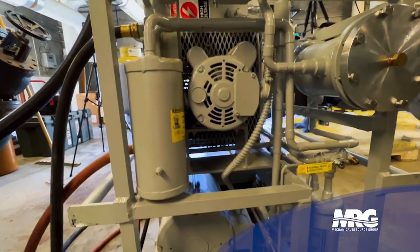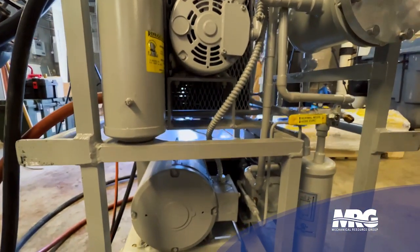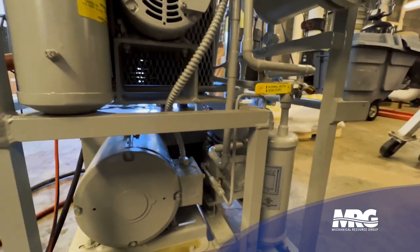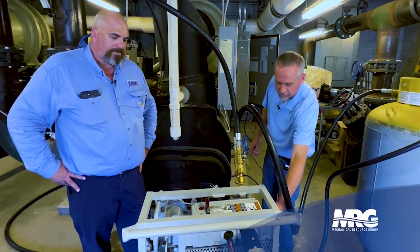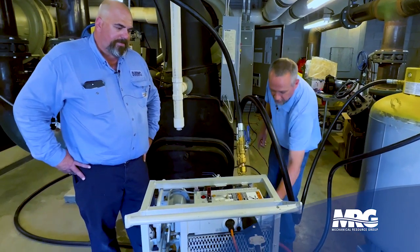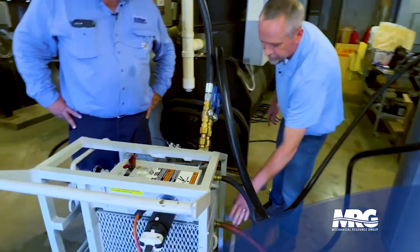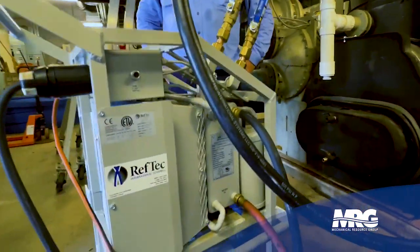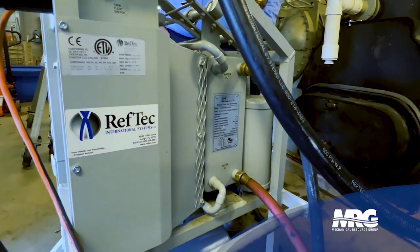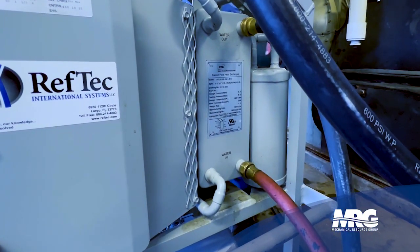The benefit is we can do air-cooled — as we're running this compressor it's getting hot because it's a pump and it's heating up on us, so we can either cool it down with this air-cooled condenser here, or we can run that refrigerant across this brazed plate heat exchanger — water and refrigerant. That is correct. Yeah, that goes a little quicker if you've got nice cold water.